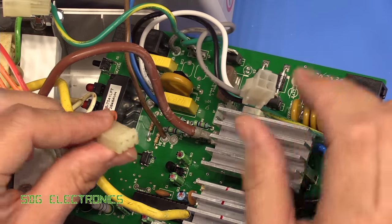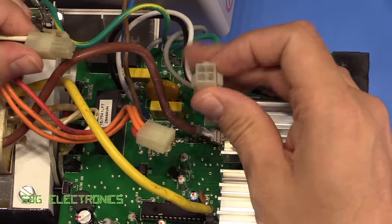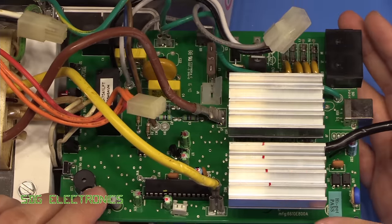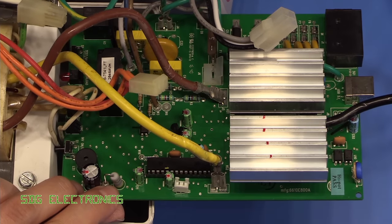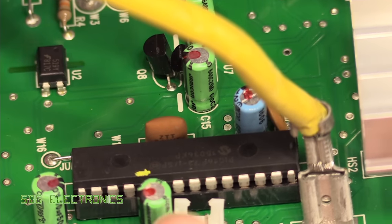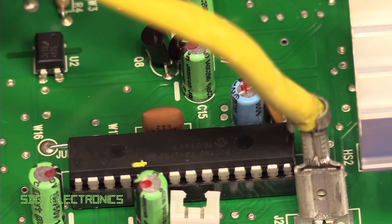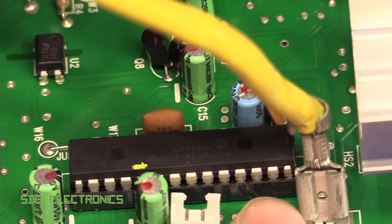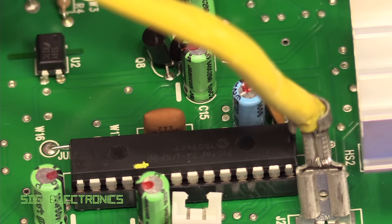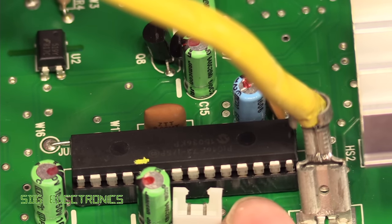There's a mishmash of connectors — one goes onto a header on the PCB but then a wire is soldered in and connects to an inline connector, when they could have just put the right connector on the board. The main microcontroller for doing the UPS conversion is a PIC 16F73 — an absolutely ancient 8-bit processor. They probably first designed the UPS ages ago and just decided never to change it. The nice thing about Microchip is they always support their old microcontrollers, so you can still buy these even though they're about 25 years old.